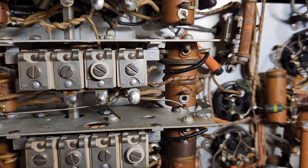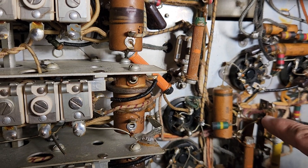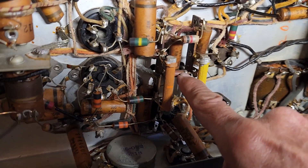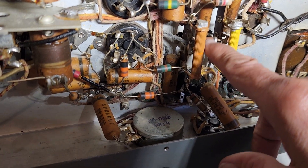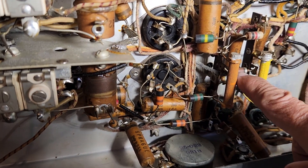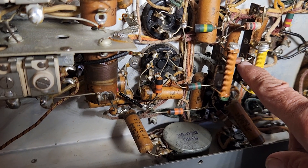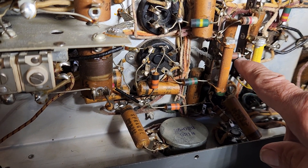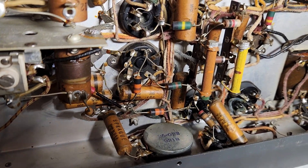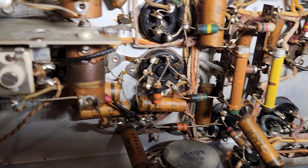It only has silver bands, so that's going to be 10% tolerance, I believe. This one's got a silver band — so 10%, if I'm not mistaken. I'm not sure what this component is here. I'll dig through the schematic and figure it out. Could be another resistor. Maybe that's one of that style of resistor where the body's brown. I would just off the top of my head say one ohm, but that's probably not the case. So I'll have to look into it.